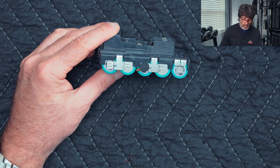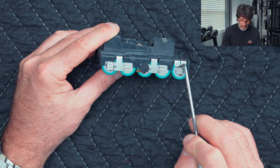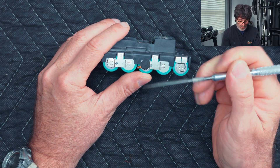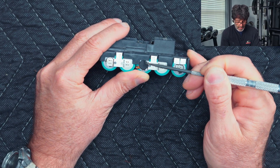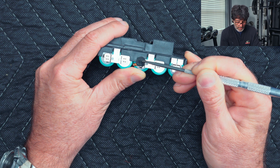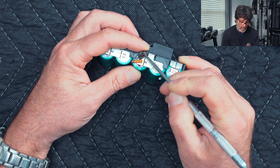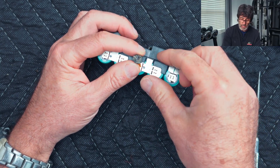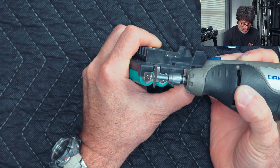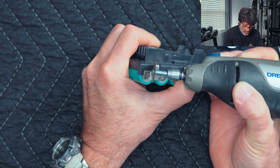What I'll usually do is use a Dremel tool to cut here, here, and here on both sides — right after we take off this little dot that holds the temperature sensor down. Just carefully pry that off. Use the thinnest wheel you've got because they cut better on this kind of stuff, and carefully make sure you don't gouge into the battery.